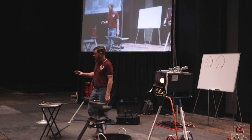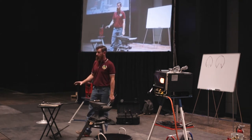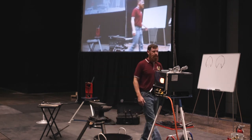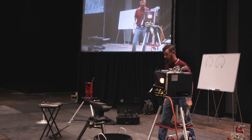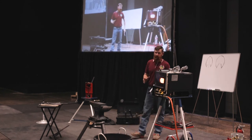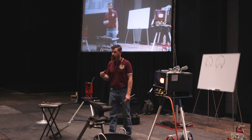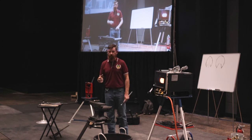Big thing too in doing that is knowing what tool I'm going to use next. Okay, it's not just at the horse that comes into play, it's also at the forge. So knowing what tool I'm going to need next, knowing exactly what I'm going to do with it, and in what process, so that you can duplicate it consistently. So with concave, I don't know how many of you guys have worked concave or not, but one of the biggest things most consistently seen in concave is a big old pucker at the heel. Okay? That comes from not understanding where the steel is moving and not understanding your point of view of where the material is going from where you're seeing it. Okay, what you think is square isn't square, and so on and so forth.